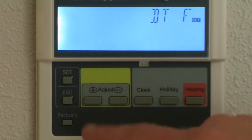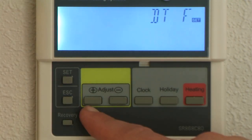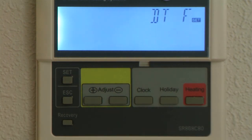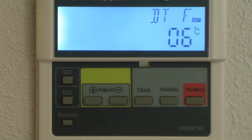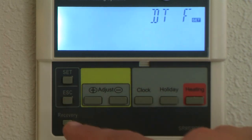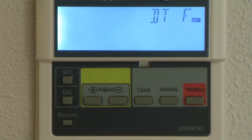To come across to DTF — which is the next thing on page 10 — just press the plus button to take you along the menu tree. DTF is the difference in temperature finish. So 12 degrees difference will turn the pump on, and when you get down to a 5 degrees difference that will turn the pump off. For a solar cylinder where you've got probe pockets you might make that as low as 4 degrees. For a retrofit cylinder where you are attaching, you would make that up to 8 degrees.